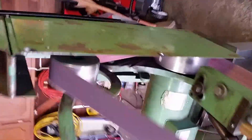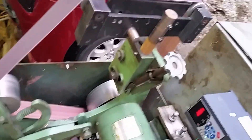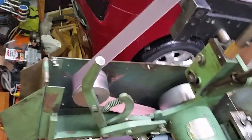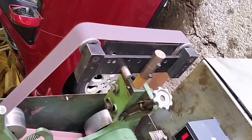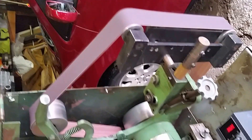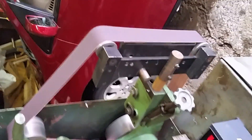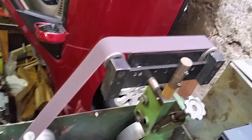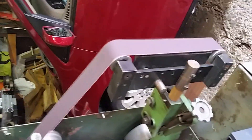I hope this gave us a little more depth and a better look at what this grinder is. Seems most people like the variable speed — I didn't worry too much about it until I tried it, and then I said, now I know what you're talking about. Let's turn her up. Now that baby's really going. One of the knife experts, Eckert I think his name is — I consider him one of the best there is — if you watch that man work, he uses 36 grit, sometimes 40 grit, and sometimes up to 7,000 feet per minute. That guy could make a knife with his eyes closed, but that's a master.